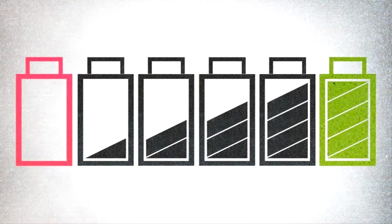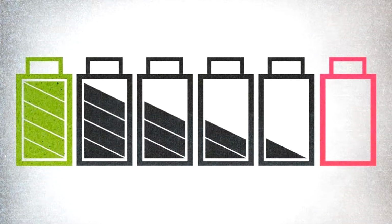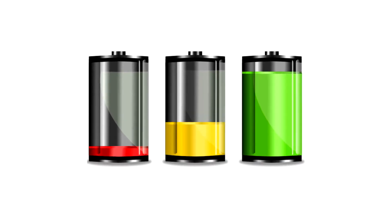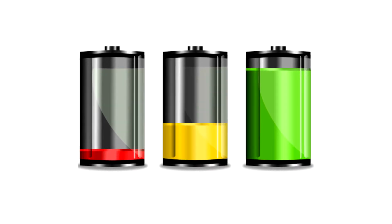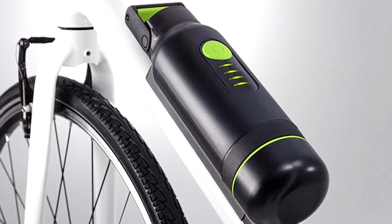You need to fully charge and discharge the battery up to 4 rounds before achieving the full capacity of the new cell. Try to discharge and then fully recharge the battery every several weeks for battery conditioning. Run the equipment under the cell's power until it turns off or until there is a low battery warning. Then, recharge the batteries as instructed in the user's manual.